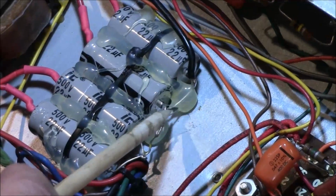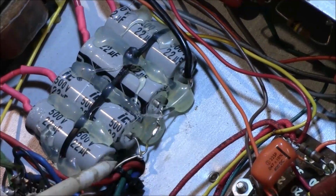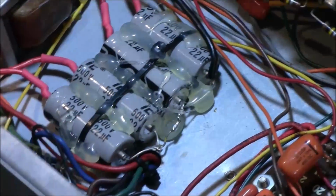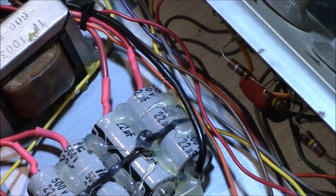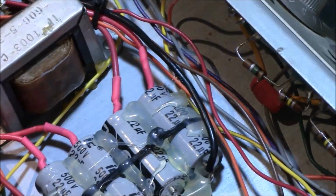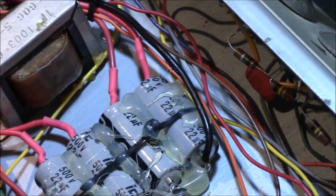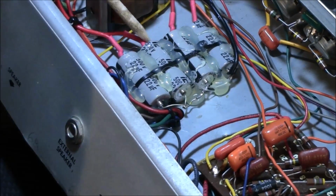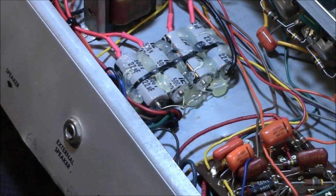But I still need to get some glue off and test these. Damn it. And he did such a great job of the shrink. Everything on this, just perfect. Dang it. I need to verify it so I don't say, oh yeah, those are okay. There shouldn't be a problem there. But I can't, because if these were just wired to one thing here, the positive side wired to one spot, I could test it. I could just take the negatives off, but I have to cut off the red heat shrink right here and unsolder and untwist all this and test these caps, just to be safe.